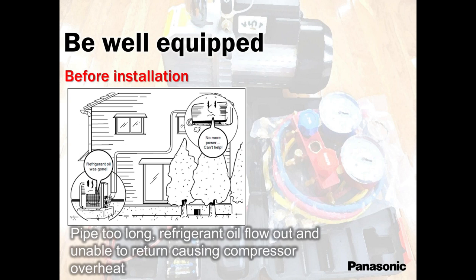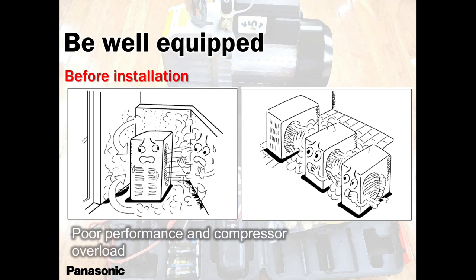And the compressor is overheating. Eventually, you have an F97 error code. Compressor overheat, F97. Why? Refrigerant. Piping is like 46 feet. No additional gas was added. This style is no good.